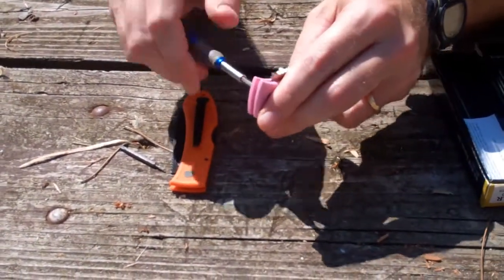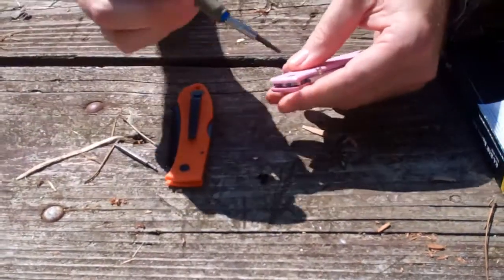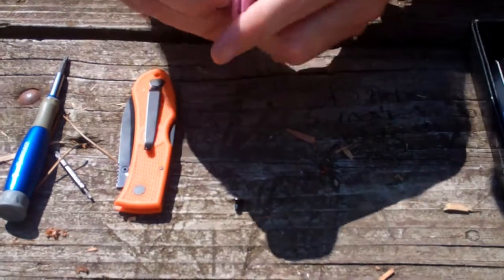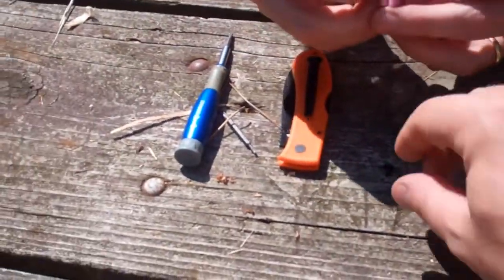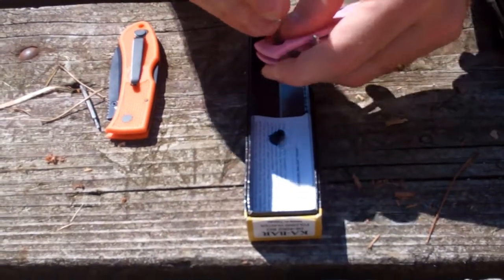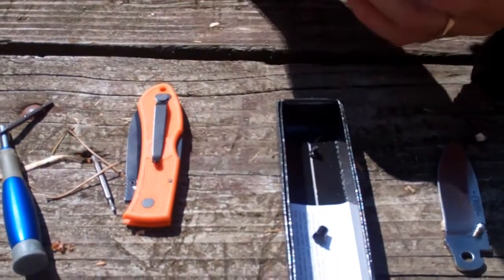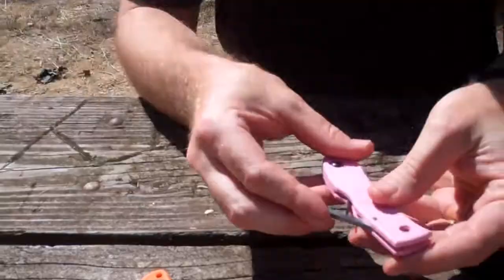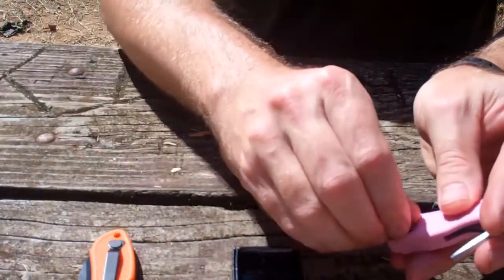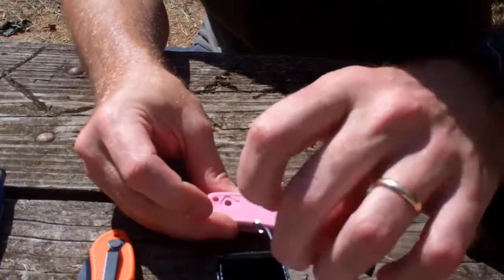This is a number 7 Torx and that's what's going to work on the thumb stud. So we're just going to start taking things apart. We're going to push the pivot screw right through and grab it on the other side — hope it doesn't fall in the dirt. We'll keep them in the box. There's going to be some spring tension probably holding it in. So your spring popped up — that's no big deal. That is on a pivot pin that we can't take out unless we punched it, and there's no reason to. Now we're going to take off the pocket clip — this is actually going to wind up on the other side of the orange blade.